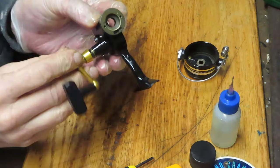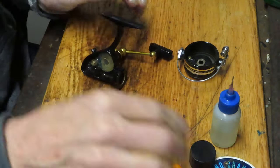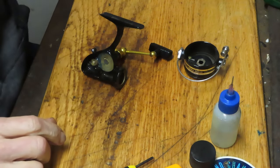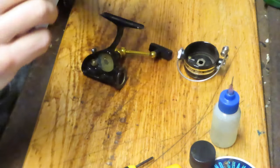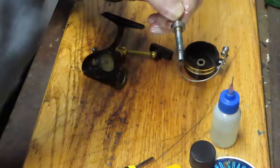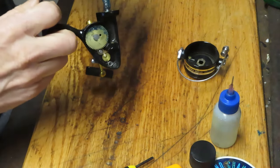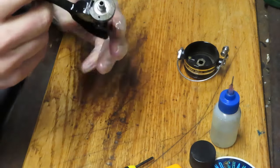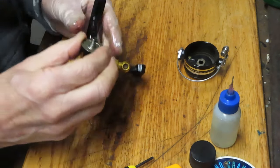Let's put the handle back on. You don't have to tighten it all the way down yet, but it does help steady the piece. Next up, we'd like to get our spiral pinion gear. We've oiled the bearing and now we can get a good amount of grease into the teeth onto the spiral gear. We can reset that into the holder. Make sure your bearing sits flush. Now we can deal with the trip lever piece — there's a side that has tapered holes that goes into the slots.